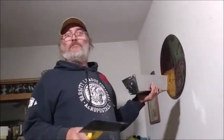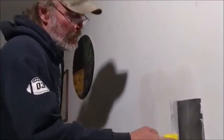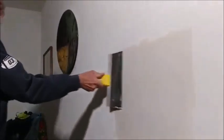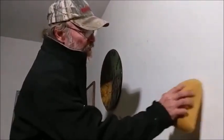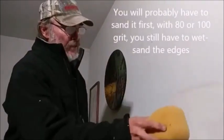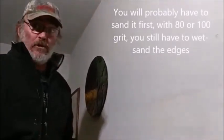We'll come back when that dries and put the final coat on it. We're back — we're going to put the second and final coat on it. Same thing, just a little pressure on the outside. And there it is — that's the finished coat right there. But you have to wet sand around the edges to feather them into the texture. If you don't, you'll leave a line. This texture is real small so it's not that big of a deal, but it will still leave a line.